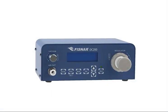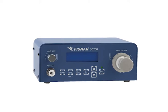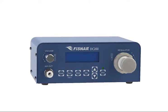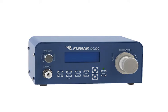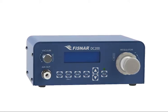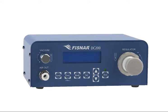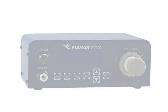Epoxy is a critical component of any fiber optic cable assembly. Controlling the amount of epoxy dispensed into a connector is essential to producing high-quality, long-lasting cable assemblies. Dispense quality control is inherently different when injecting manually — the dispense quality depends on the skill and experience of the operator. The DC-200 from FISNAR automates the injection process, removing variables associated with manual injection, providing consistent and accurate epoxy dispensing, resulting in high-quality, reliable terminations.